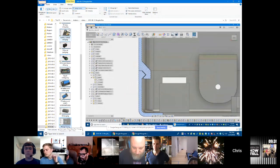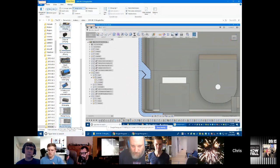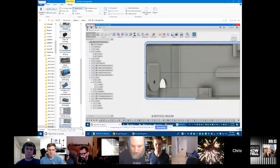I originally tried to make it a snap fit using some examples that Noe and Pedro did, but because the sides of the box are rather thin and the seam is in the middle of the box instead of right at the lid, the sides are too flexible, and so it comes apart much too easily. So instead, I added some little tabs where I can stick some screws in it.